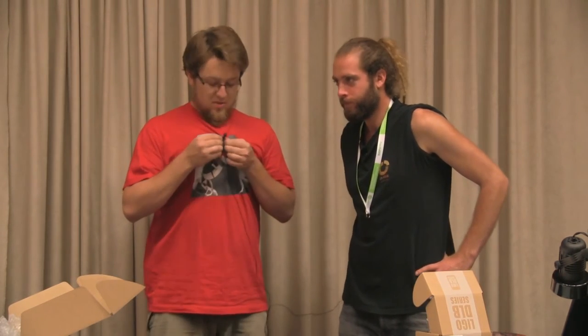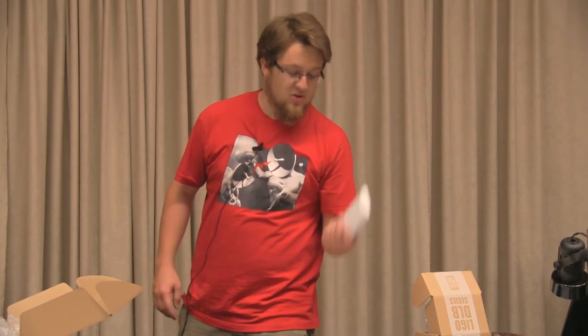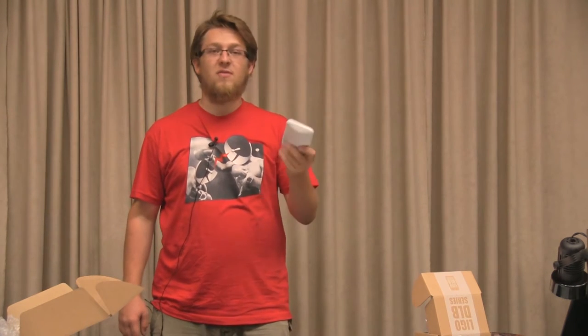These devices are very nice, actually, because they have enough flash and RAM. In stock, they run two firmwares, so firmware 1 and firmware 2. They sent us their patches for OpenWRT. We managed to add them in the builder so we can build OpenWRT images for that and overwrite just the first firmware with an OpenWRT image. So you can just run that, and if that fails, for any reason, it defaults back to their factory firmware. So that's very nice for testing.